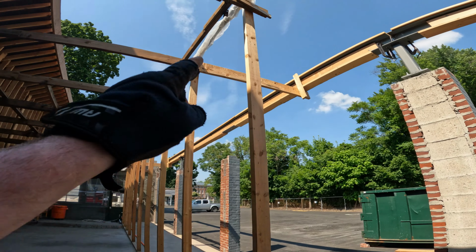Those leveling nuts worked out perfectly though. Our system was great. We brought that post down below where it needed to be and used the leveling nuts, made sure it was level, and then we slowly brought it up to where it needed to be by doing a quarter turn on each nut sequentially until it was right where it needed to be.